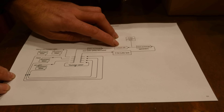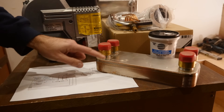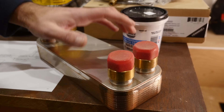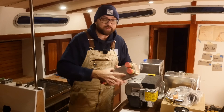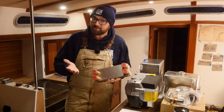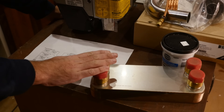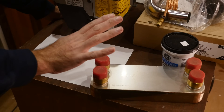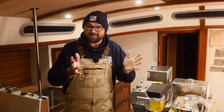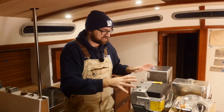Let's start here with the ProHeat X30, the heat source in the system. When the heated fluid exits the X30, the first thing it's gonna encounter is this 16 kilowatt heat exchanger. This is what we'll use for heating hot water here aboard the boat — for instance the shower or the galley. We won't have a traditional hot water heater; instead we'll be relying on this heat exchanger, which means unlimited hot showers. We are of course limited by the amount of fresh water we're carrying aboard, but should we ever find ourselves in a marina with a hookup to city water, it's gonna be a shower palooza. There are valid reasons for going with a traditional water heater or a heat exchanger like what we're doing here, but if you're putting together a system like this I highly encourage you to do your own research to see which option you like best.